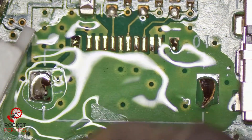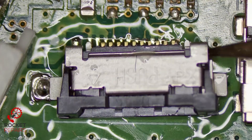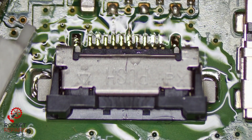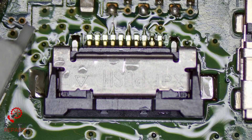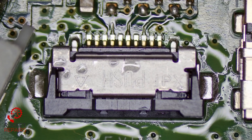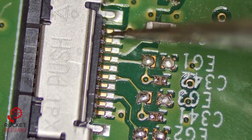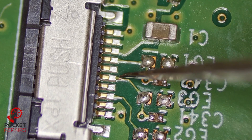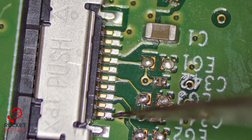Try and get it in line as best we can because when the solder liquefies it's just going to take hold. It's actually going to be a little bit easier to put this on when we have hot air applied and the solder is liquefied. There we go — the solder has liquefied. There might be one pin that is struggling but it might have just popped into place. They all look absolutely solid but I'm going to run over them to double check. Every single one is solid — that's really good.